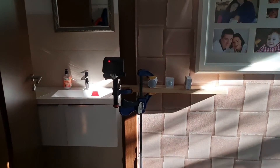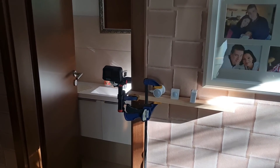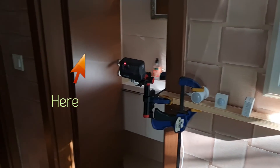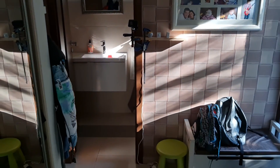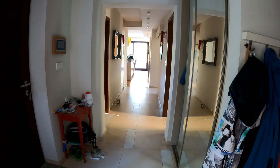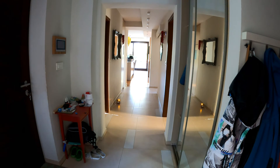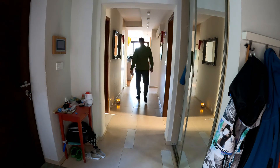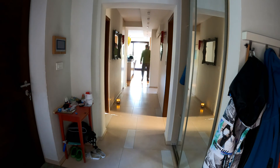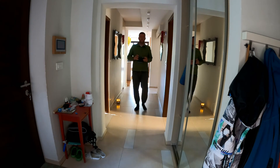There was one final interesting scenario from the corridor scene. My bathroom was just behind the sensors and cameras, and I noticed that even when I was behind the radar sensor with the door open, the sensor could pick up my motion within the toilet through what was probably radar reflection off the walls. It reported presence even before I moved in front of the sensor. So if you notice these fringe behaviors, it's likely radar reflection — especially if that reflection source is fairly close to the sensor.